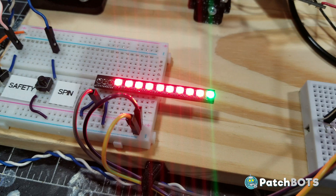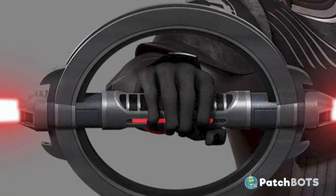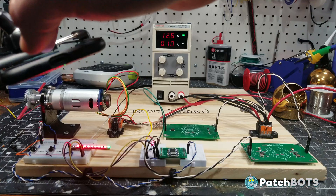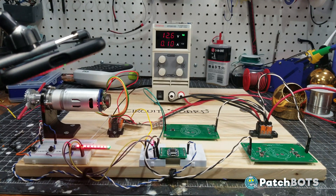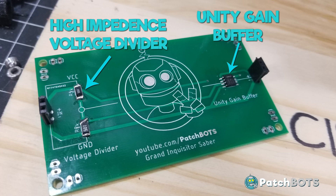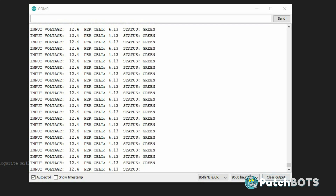Also on the user interface side of things I'm going to add in the decorative lighting of the project. The Grand Inquisitor Saber has 16 red LEDs on the front. These 16 LEDs are represented by the first 9 NeoPixels on this 10-NeoPixel strip here, and the last one — this little green one — is going to be a little more functional; it's going to act as a battery indicator. I made this battery monitor board consisting of a high-impedance voltage divider and a unity-gain buffer that will allow the Arduino to read the voltage of the battery and give us some feedback via the extra NeoPixel.